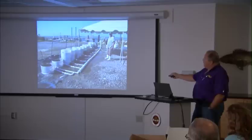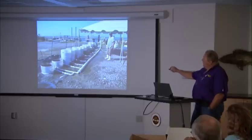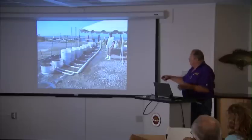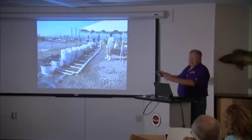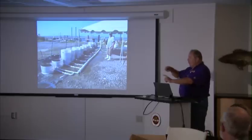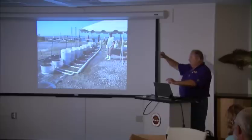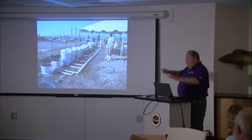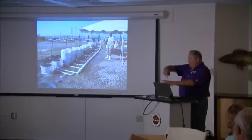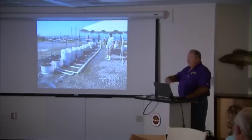And what's beautiful about this is when you cut this up, what's the top of the drum becomes the bottom of the silo base. Then you flip this upside down, and I've made a circular piece of plywood with four triangles in it that makes a 1-inch by 1-inch support grid. You lay that on top of that drum and draw out your four triangles with a Sharpie, and then you drill a pilot hole and cut them out.